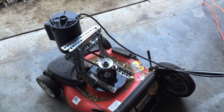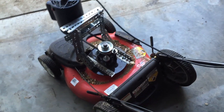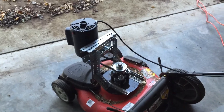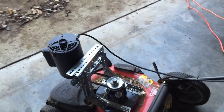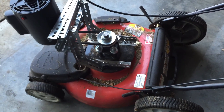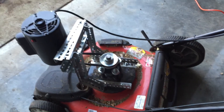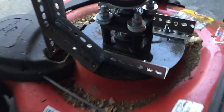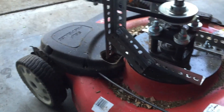I started working on this project and thought, hey, lawnmowers aren't that complicated — I think I could probably do this myself, maybe even better. So this is my electric lawnmower. Basically, I've got a mount underneath with a couple of pillow block flange bearings stacked right on top of one another that hold the blade underneath. It is self-propelled — you really couldn't push this thing if it wasn't.